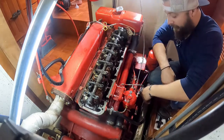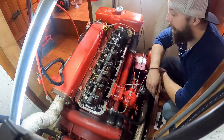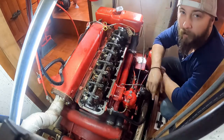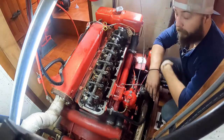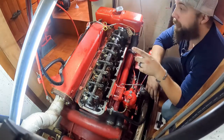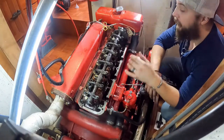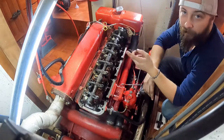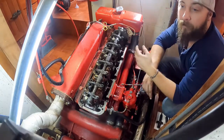We've got good diesel. This thing also, when we got it, had a lot of water in it. My concern is that someone was running it for a while without checking the tank. Moral of that story — even if your rig is running fine on a boat, check your tanks for water. The pickup's an inch or two off the bottom of the tank. I actually took the top off and shoved a hand pump with some clear tube all the way to the bottom and pumped everything from the bottom — there were literally inches of water. Most people don't look for water that hard until it's in the system. If you use red dye off-road diesel, pump the bottom out until you see that red dye come through.